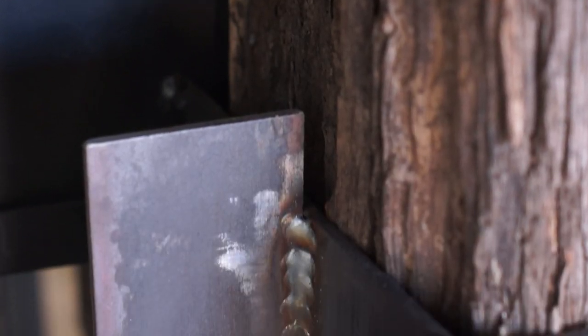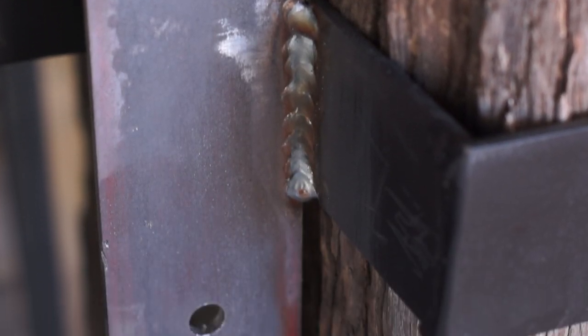So I learned a valuable lesson this afternoon. Before I took the welder and my generator down to the letterbox to weld the letterbox onto the pole that's concreted into the ground, I thought I'd do a test, and I learned that my generator does not have enough power to power the arc welder. So I'm going to have to either find a more powerful generator or secure the letterbox to the pole in a different way. I decided to weld on a piece of flat bar that joins both the bands.